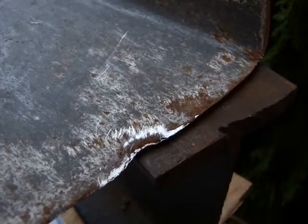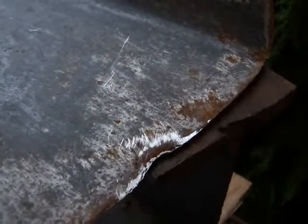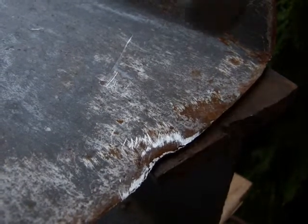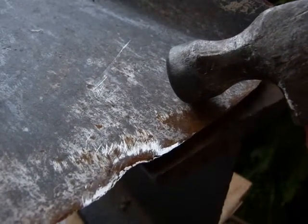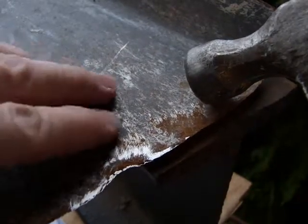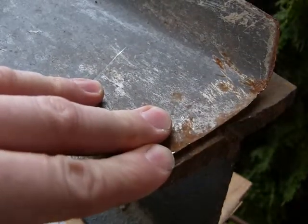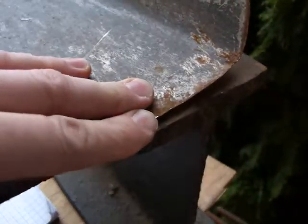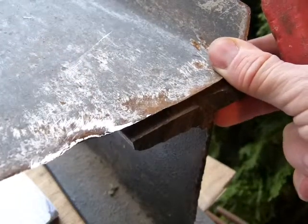Okay, particularly the aluminum shovels. They make aluminum shovels as well. Guess what? They fail way more often than low carbon steel. This is low carbon steel. Aluminum shovels weigh half as much, check, but because you're hitting the concrete driveway or sidewalk with the metal blade all the time, aluminum shovels, and nobody makes scrapers out of aluminum, okay, but they make aluminum shovels, they fail at the edge miserably and spectacularly.